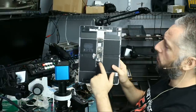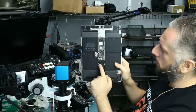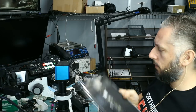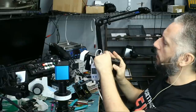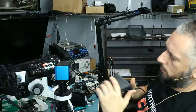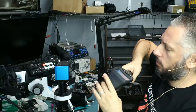What I did is remove the black shield, remove the plate that goes over the screen FPC connectors, and disconnect the battery from the motherboard. We're going to connect the cable — I'm not going to power it on yet. I have the cable plugged into an amp meter plugged into a power bank. Right now I'm going to turn the thermal cam on first.